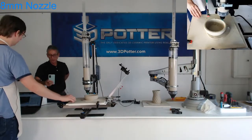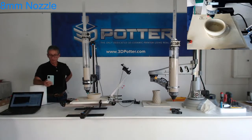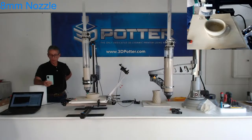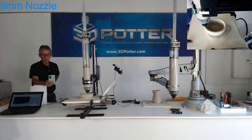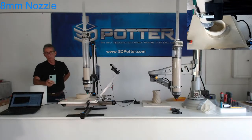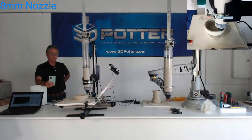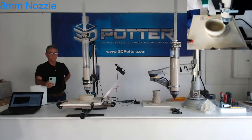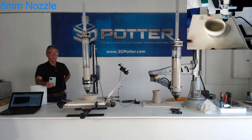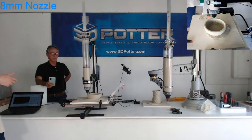I have a question. I have an earlier model extruder, and they want to know if the retraction hardware has changed. He's talking about retraction, and the answer is yes. So there's a lot of changes. If you have a version 9, say the 9 Pro or higher, retraction would be possible with some tweaking of the config, and documentation's out there.